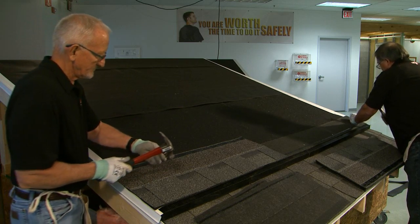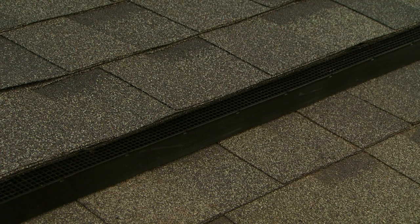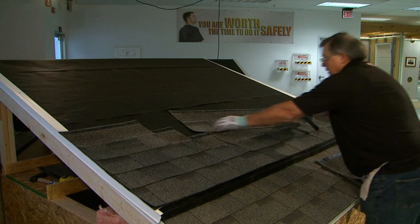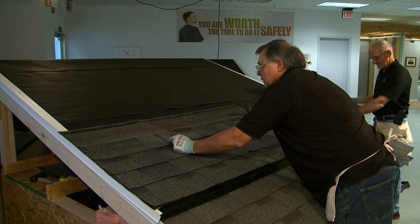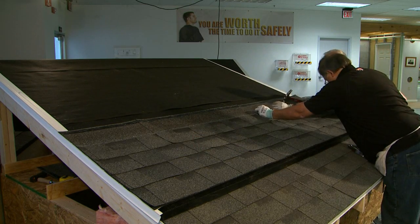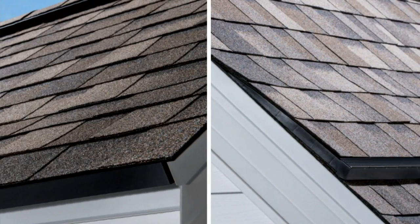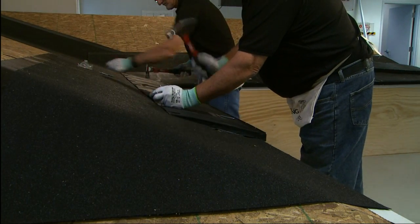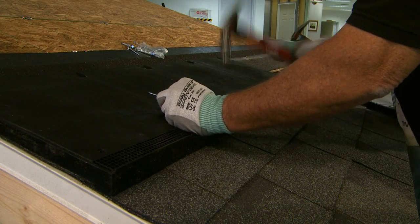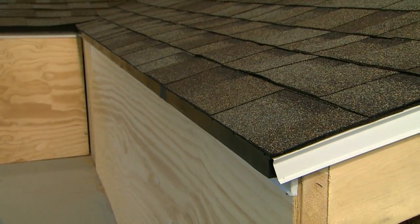It's important to be certain not to cover the inflow vent's top intake openings, as this will allow air intake through the top of the vent. You can now continue to install the roofing system. Once beyond the inflow vent, a nail gun and standard roofing nails can be used to install shingle courses according to the shingle manufacturer's specification. The VentSure Inflow Vent is part of a balanced air ventilation system from Owens Corning. When properly installed, this system will help protect your customer's roofing investment, provide natural ventilation of the attic space, and help enhance your reputation as a knowledgeable roofing professional.